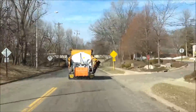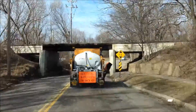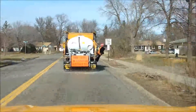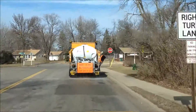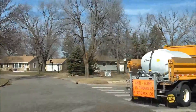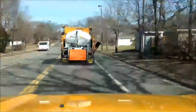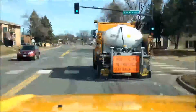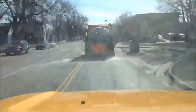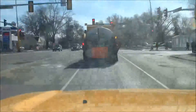By pre-treating the road with salt brine we accomplish a number of things. First, we can put down a product before the event, which gives us the advantage. Second, it prevents the bond of snowpack to the pavement, making it easier for the plows to plow it off the road. Third, sometimes during the morning, bridge decks can get a layer of frost or ice — anti-icing prior to the event helps prevent this. Also, during an event we use less salt on the road because we pre-treated it beforehand.